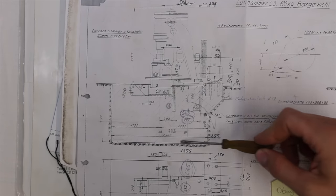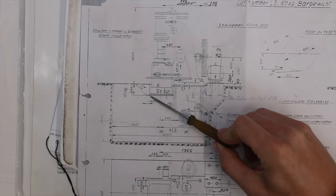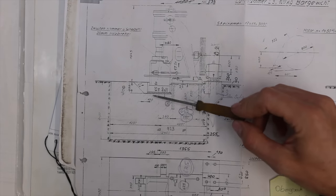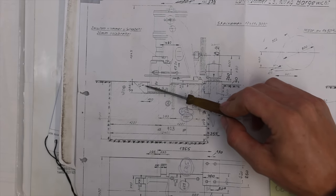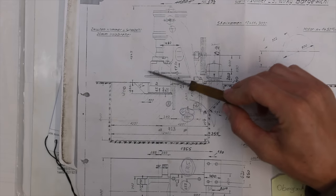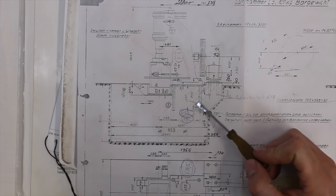All in here is concrete. As you can see, this is the anvil and it's actually set underneath the ground. The hammer sits flush. The problem with this for me is because I'm such a tall guy, it's way too low. Last time I did this, I actually made it just a little bit under the ground. I'm going to go even further this time — the hammer is going to be sitting flush on the floor, and it's going to be raised up to maintain that relationship between hammer and anvil so the ram doesn't overextend and destroy the hammer. Let's jump back to the shop and get working on this foundation.